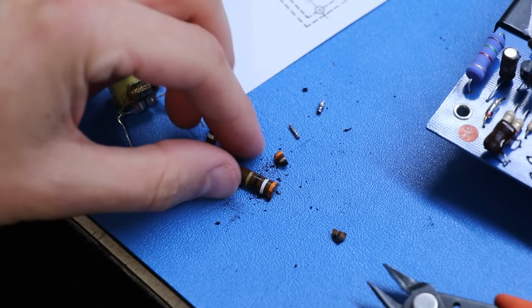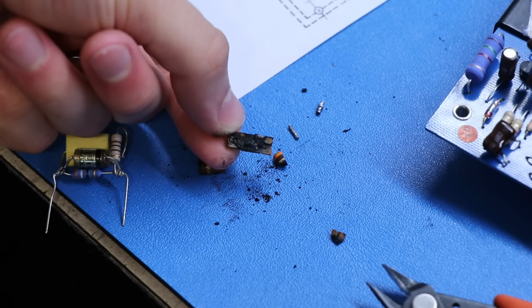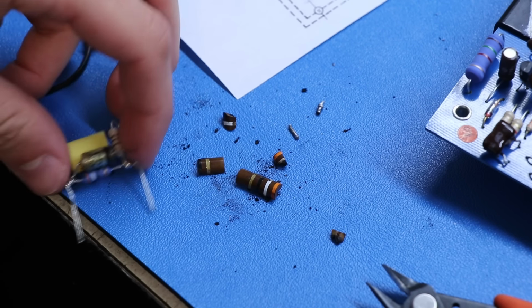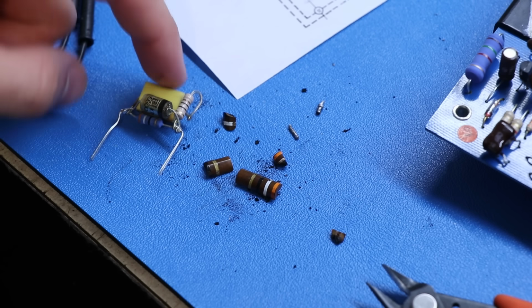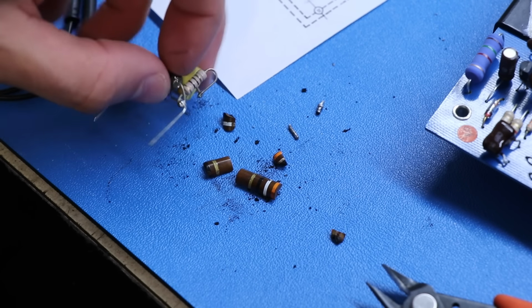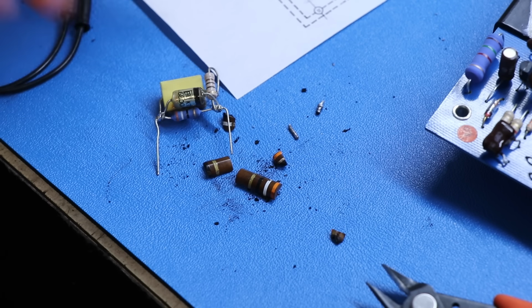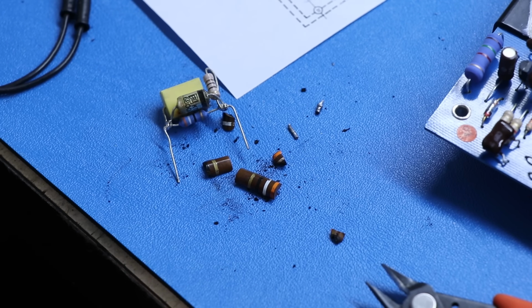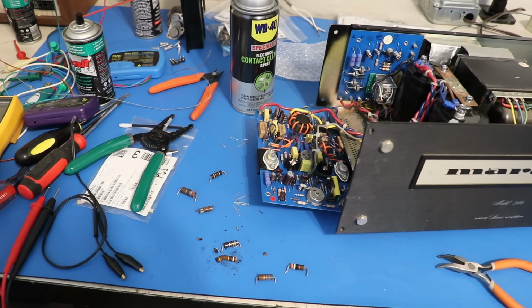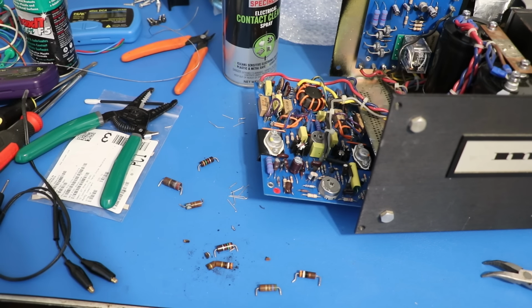Well, you can see I got the assembly apart. This is the old resistor, and it looks like that on the inside. Yeah, just a bunch of carbon. And then each of these components, these are both capacitors, they each tested good. This resistor tested good. So now we have a proper 39 ohm resistor on here, metal oxide, and we can get that installed in the board right now. Alright, here's what happened. So there's 7 carbon comp resistors.